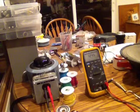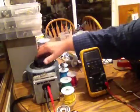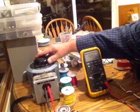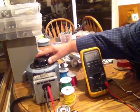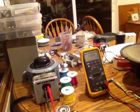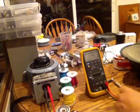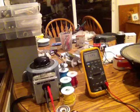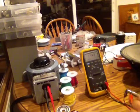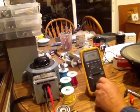You would set your Variac for 11 and a half volts. If you're looking at my voltmeter right there, you're going to see probably 124 line voltage. I'm going to take it right down to about 11.51 volts AC. What you do at that point is hook up two leads to the speaker — this is going to send a 60 hertz signal into the speaker at 11 volts, which would be about a third power.